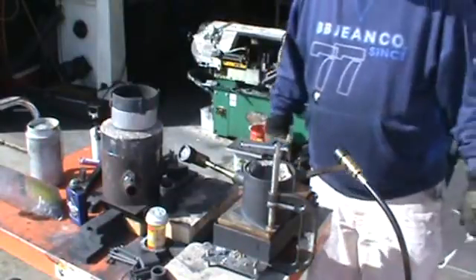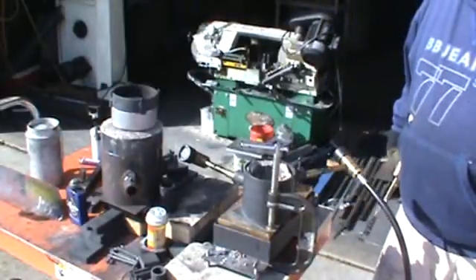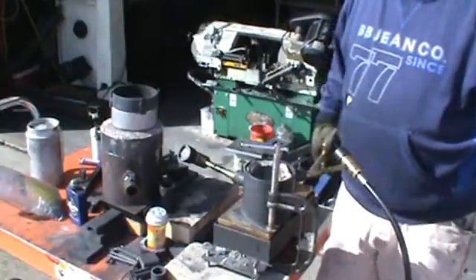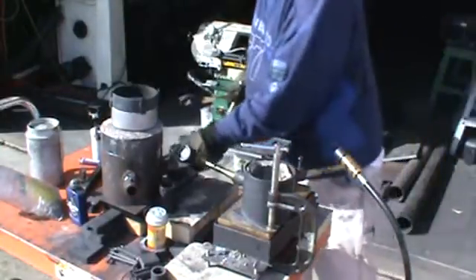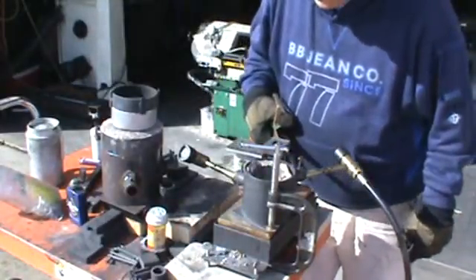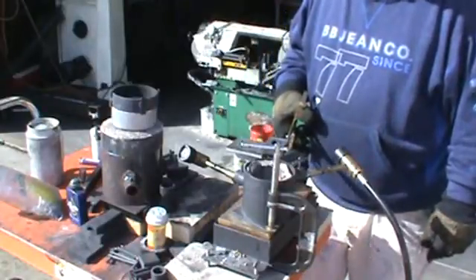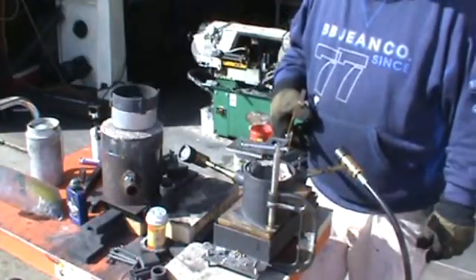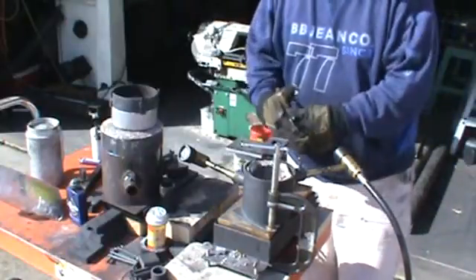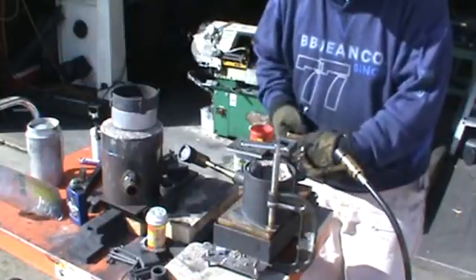The purpose of the clamp is just to hold the two pieces together, and the fact that all of the graphite expands at the same rate means it stays reasonably tight. I do not want to open that up too soon. I have opened them before, gotten in too big of a hurry, and when I took it apart part of the ingot poured out. I would think that it is cool enough now.